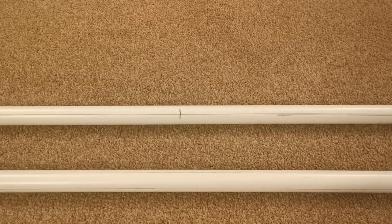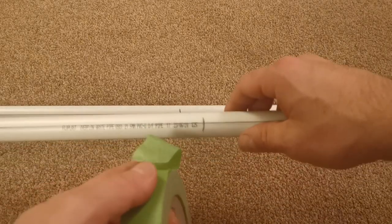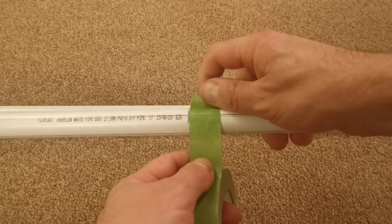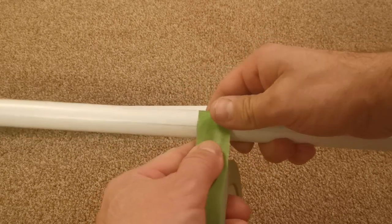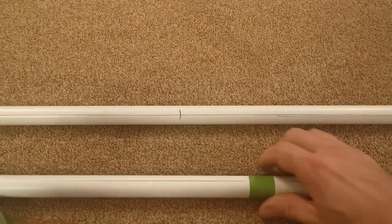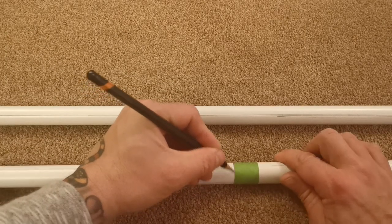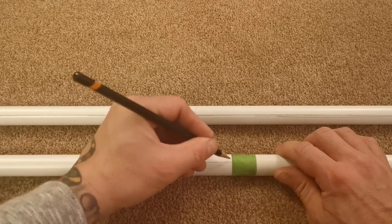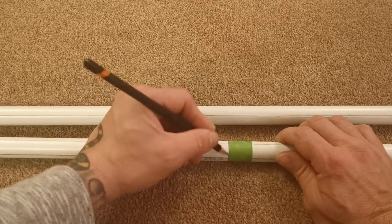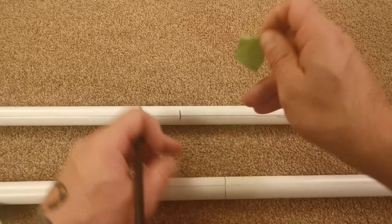You can take the tape around that mark and as long as your tape matches up as it comes around, you can use that to mark your center line roughly all the way around. I'm going to take the pencil line that's on the opposite side of the printed writing - starting from the center - and mark with the Sharpie every centimeter: 90 centimeters to the right and 90 centimeters to the left. That gives me 180 centimeters marked, which gives me a six-foot working jig.